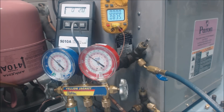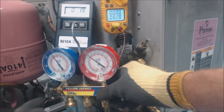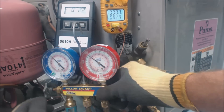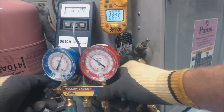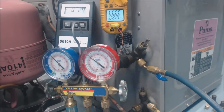You don't want liquid refrigerant going into the compressor. This is an Imperial quick charge 535. If you don't have one, you're just going to be opening the handle up just a little bit — just a slight restriction — which will allow the refrigerant to go through, but it's going to make the charging process take longer. So we added three ounces of refrigerant; now we're going to let it sit for a second to see where we're at.